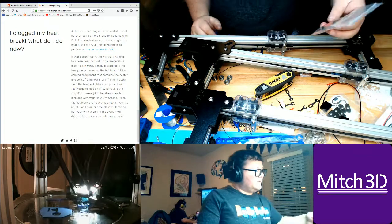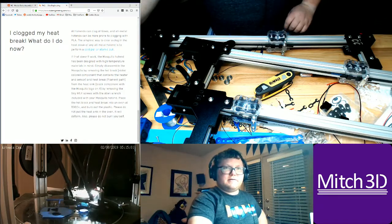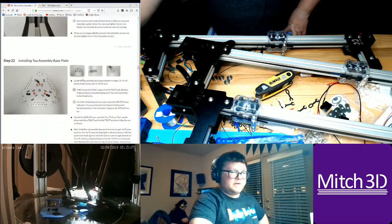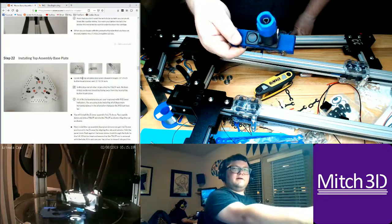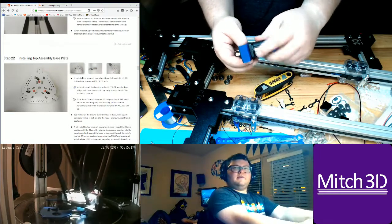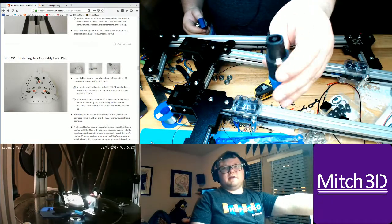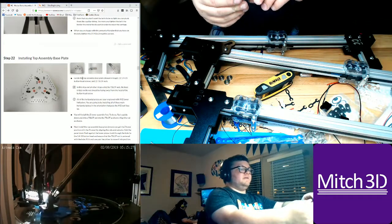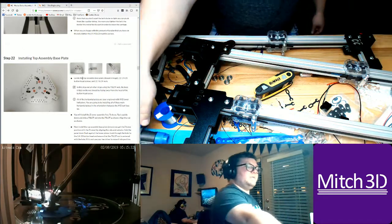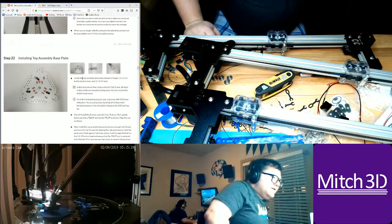It also is not going to be just a backpack. It's going to do other things. I want it to actually be portable. So again, I bought these, they're called Speakon connectors, and they're twist to connect, high current draw. Chris from Practical Printing came up with this as a heat bed solution. So I can add an Orion heat bed and then use this as a high current draw with an Xbox 360 power supply, which I have one. It's a 200 watt or 190 watt, which is plenty of power.